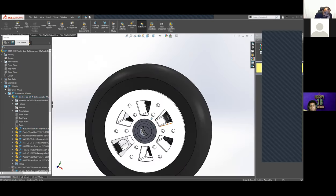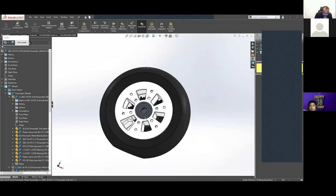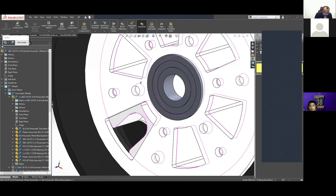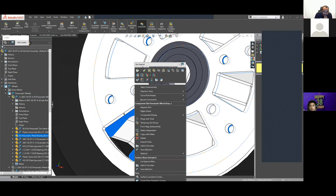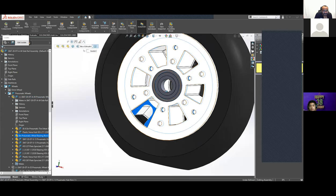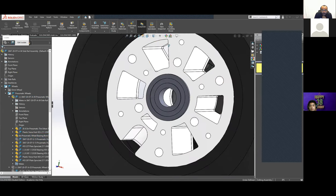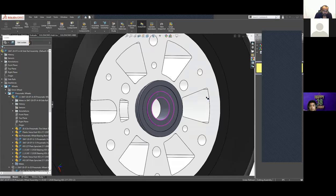So our pneumatic wheels use custom hubs. They could use the same hubs that Andymark wheels use. They're the same size, but we chose to design and produce custom hubs. The inside part is a 3D printed part that just sits on the inside and holds the bearings. The outsides are sheet metal